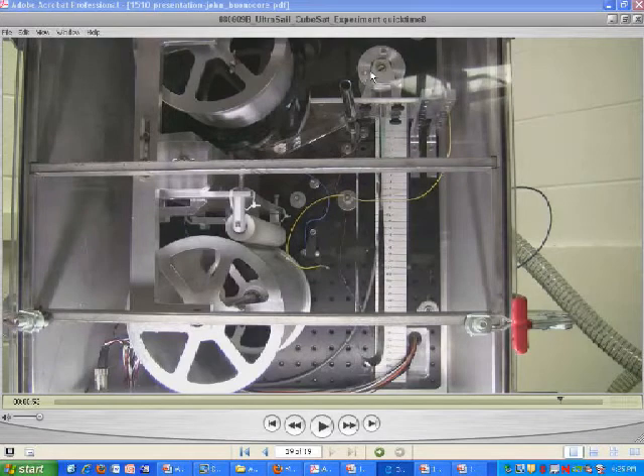The hinges are just custom-designed — we'll machine them out of aluminum. We designed the hinges according to off-the-shelf torsion springs, because making a custom spring is kind of hard and controlling the torque it offers is tricky. We're using small springs bought online — the smallest possible spring — and designed the hinge accordingly.